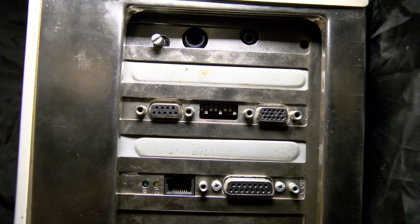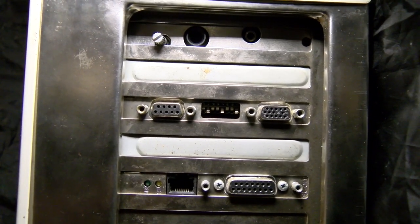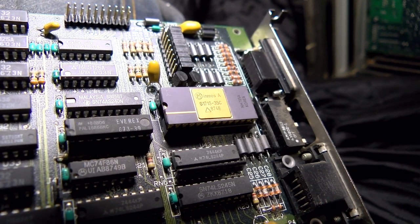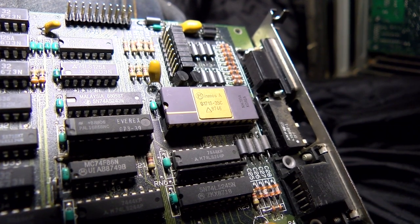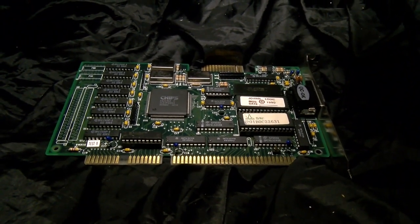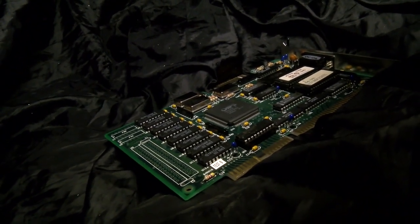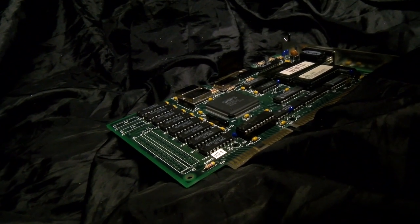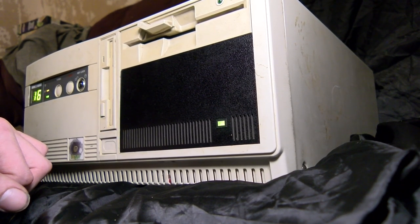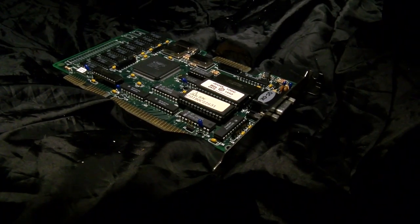One notable feature of these older cards is that they could even be set up to use monitors from CGA and EGA, but when using one with an analog VGA monitor you'll still usually get digital-to-analog and scan rate conversion. There are no SVGA resolutions, no acceleration, and the DAC is quite limited — and that's not just on clone cards, the original IBM VGA card from that year was pretty much plain VGA. You might be able to get some later 16-bit cards to work in old 8-bit slots, but you'll be screwed if the card's BIOS uses any 386 instructions.